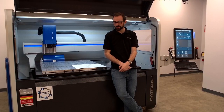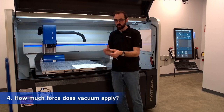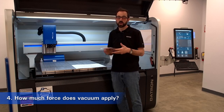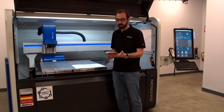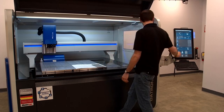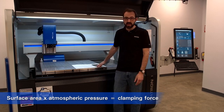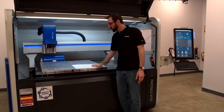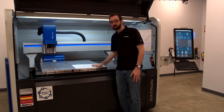The next question is: how much clamping force does vacuum work holding apply? It's not actually vacuum that holds your piece down — it's atmospheric pressure. At sea level that's 14.7 pounds per square inch; up in the Rockies it might be less. Take a piece of material roughly 12 inches by 5.5 inches — about 66 square inches. That equates to nearly 1,000 pounds of clamping force, just shy of half a ton. So it's basically not going to move. On top of that, the clamping force doesn't have to be as great when you're using a high-RPM spindle. Pair high-RPM spindles, low cutting forces, and sufficient clamping force — you've got everything you need.